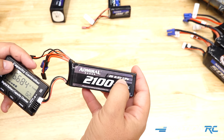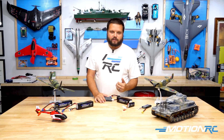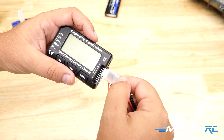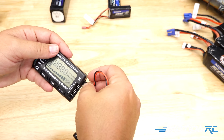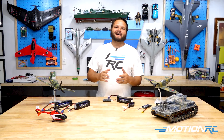That's kind of the checker — it's really simple. You have your type and your cell buttons. There's not a lot of stuff to worry about or things that can go wrong. Just plug the battery in according to the little chart. You're going to use the balance lead for any kind of LiPo. You also have a three-prong connector that is a standard servo input to do NiCads and nickel metal hydrides.